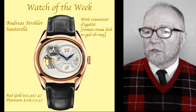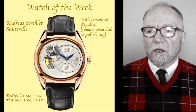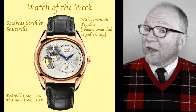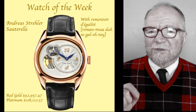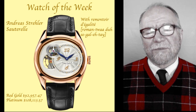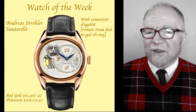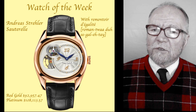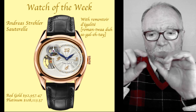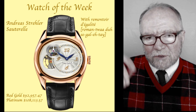So we're going to start with taking a look at one solution, and that solution is called the remontoir d'égalité. Okay, égalité is from the French revolutionary term liberty, equality, and fraternity. The égalité is the equality, and so here the remontoir d'égalité is equaling. How do we equal the power in a watch so it's constantly at the same speed?